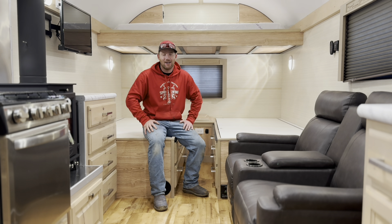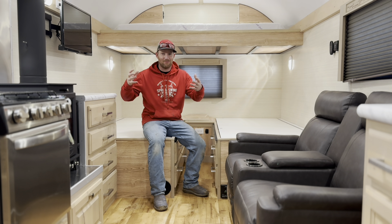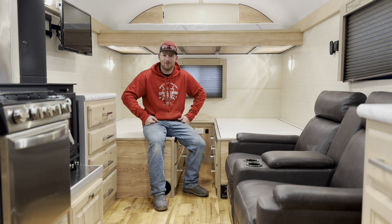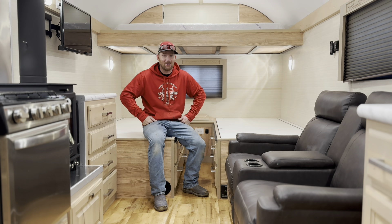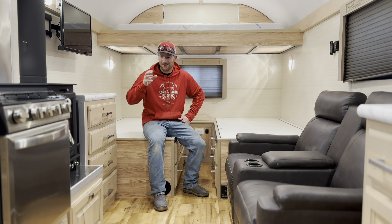I'm not saying we don't want to use the wood stove — that's probably why you bought the camp. What I'm saying is we have now come out with a way to utilize the heat from the wood stove to distribute air better in the camp and keep those tank enclosures warm. Even if you do have heating elements on your tanks, they draw a lot of power. If you're getting a lot of overcast days where your solar isn't producing much, you're going to want to conserve that battery power.